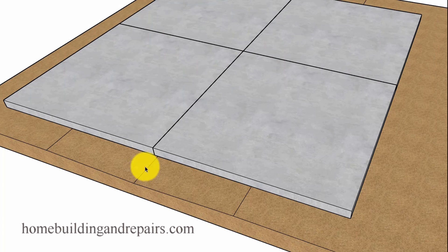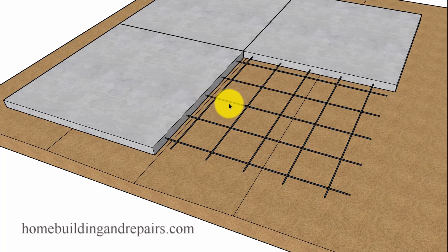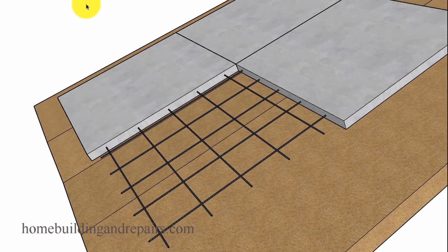Of course, we also have tree roots. A tree root grows underneath the driveway and it can raise it and do considerable damage. But by joining everything together with the rebar, it's going to take a lot more pressure to move this. Some of the smaller pockets won't even be affected because the rebar is going to be connecting everything together and holding it in place.